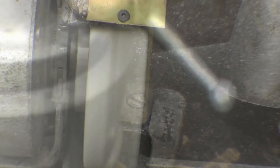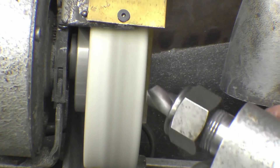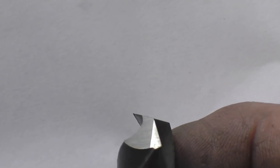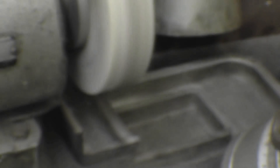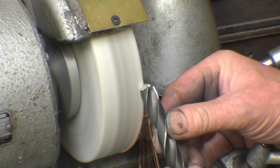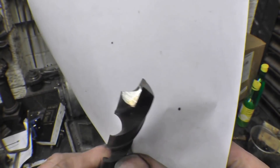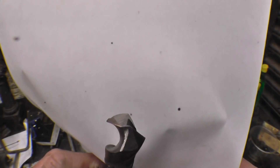What I'm going to do is put a little bit more angle on — it's at 5 degrees, we'll put that to 15 — and take some of that off, just put a little bit more relief on there. Very quickly you can see that now, that's the cutting edge down there, that's the other side, there's loads of metal on it. Now what we can do is grind some of this out and thin the web of the drill down so that the chisel point becomes narrower — we'll just do that by hand. Hopefully you can see how it's thinned out the actual web of the drill. We'll put it in the machine and try drilling a hole and see exactly what it does.